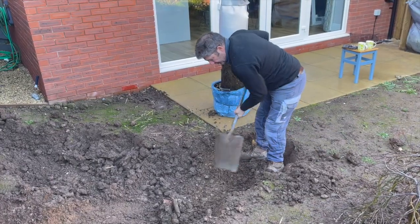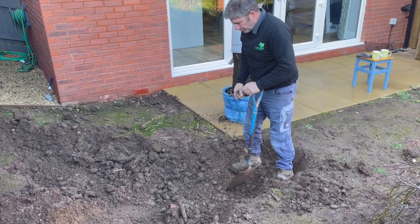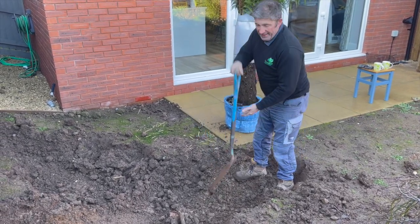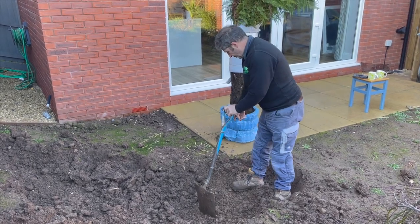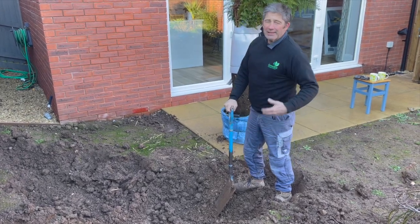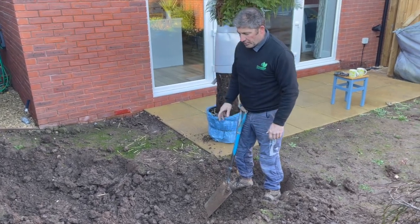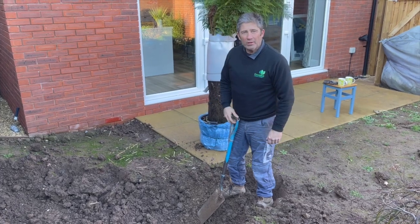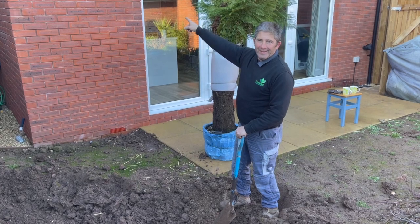There you are. We've had a little dig around here, and now we're starting to hit stony ground. That's one spit, one shovelful, about 12 inches below the existing level on that side. Because it's a bit unstable, not like a natural dig all the way through, we'll probably put a membrane on throughout as a stabiliser as well. And you always remember, you've got the Bristol Channel just there, haven't you?